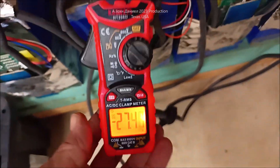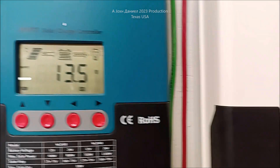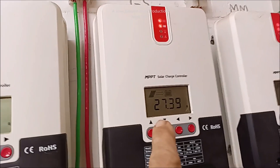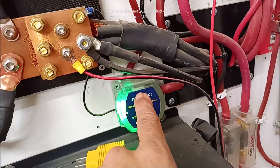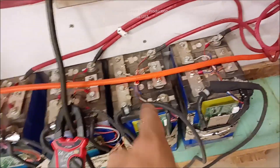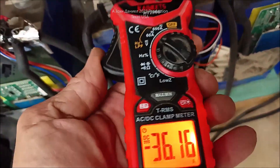26, 28 amps — it's going to continue flowing backwards because the battery voltage has dropped due to clouds. These are normally about 38 amps so they've all dropped — it's very cloudy today. This connects to battery banks: a lithium Apollo lithium battery bank and a lead acid battery bank. Right now these batteries are back-feeding. How do I know it's back-feeding? You see that minus sign — it's back-feeding.